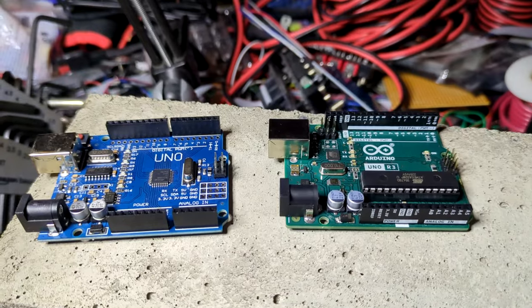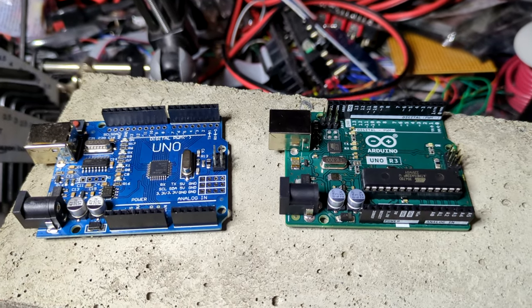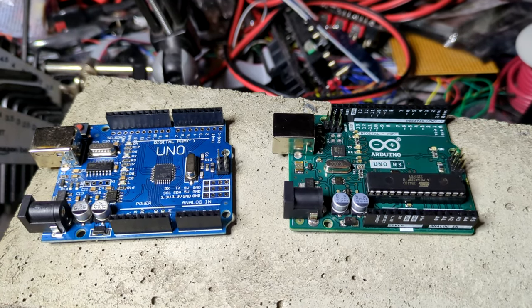Except for how the Arduino clone that came with the kit kept rebooting itself randomly after 5 to 10 minutes of operation. I spent days trying to solve that problem before finally thinking to swap in a real Arduino, at which point it magically went away.